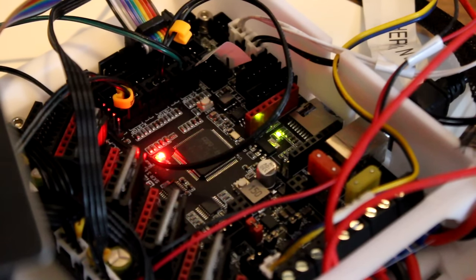So, Klipper — can we just skip this bit? No? Ok then. Klipper is a thing of two parts. One part goes on the Raspberry Pi, which you need to run Klipper. The Pi imager even has an option for it — make sure you configure the WiFi and username in the settings. Then that microSD goes into the Raspberry Pi. You compile a bin file which goes onto the printer as the firmware, the same way the Marlin one did. BigTreeTech do provide one of these and I think it will work, but I made mine using the on-screen process.